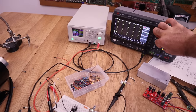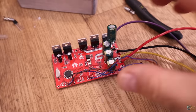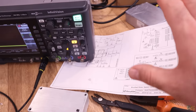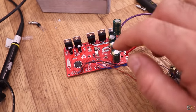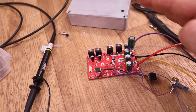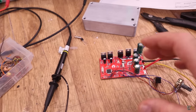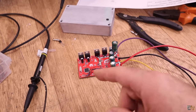We can also see the PWM signal on the oscilloscope. The PCB still has a BJT added externally because I had to modify the schematic slightly — the final schematic will be posted when the project is published. Also missing is a small IC: the current sensing chip. I'm using a Hall effect chip to sense current — you set a limit in code, and if the current exceeds that limit, it decreases the PWM signal to keep current constant. Speed control works via a Hall sensor on the wheel or motor to count RPMs, and if you know the wheel perimeter, you can calculate speed.